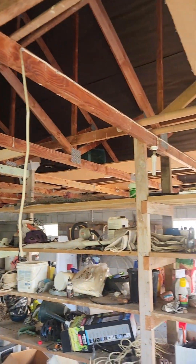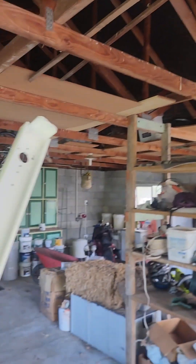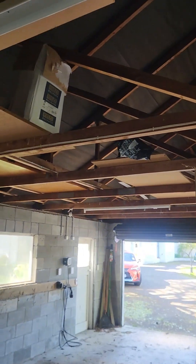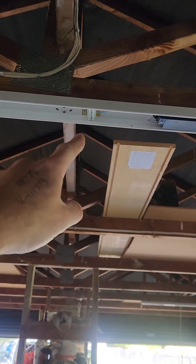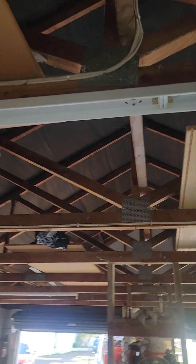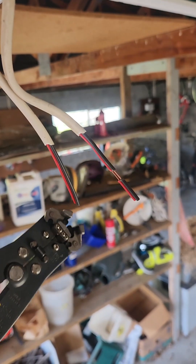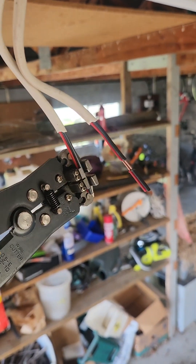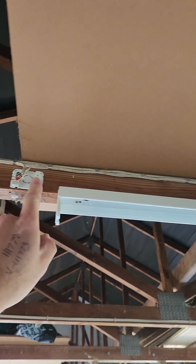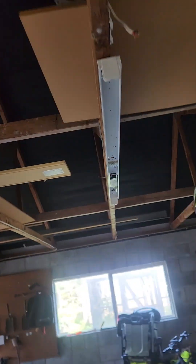I've got some Barrys here for a nice little light upgrade, just gonna put three in — one down there, one just here, and one there. So I've got my three lights up, just gotta reroute the cables a little bit, get them in, and then I've got to run a bonding earth for each of the lights because the old cable is only twin, not twin and earth. This last one — the old light was there, so I'm gonna J-box from there to the new spot because he wanted it centered.